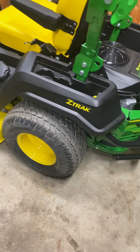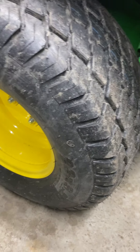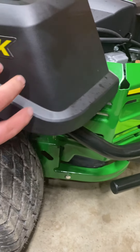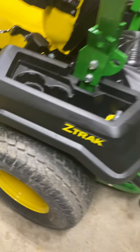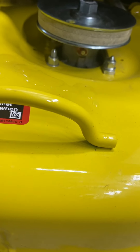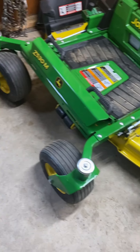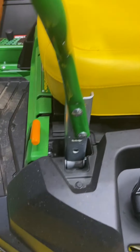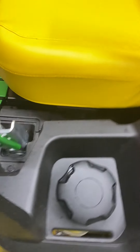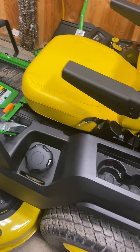I've just had this a couple of weeks and I really like it. The R does come with 23-inch tires — these are 22 — and the R also has a fancy green trim piece, but that's probably just something else to get busted off. Underneath here this flips up and you've got your grease points right there — grease fittings on all the hubs. Cub Cadet had none, which was unfortunate. Everything's pretty well greasable on it. These levers are adjustable — I put them in the highest position and moved them forward. I'm tall, so that worked best for me.